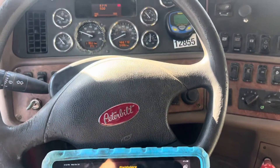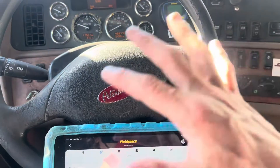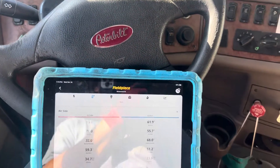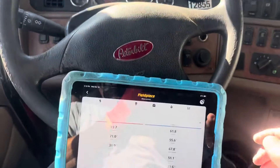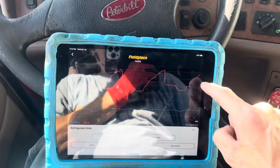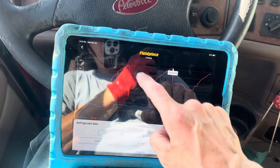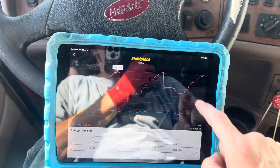We're out in this vehicle, you can see we're at idle. I'm going to have to touch the pedal because it's going to shut off — we're in California, so on diesels they have to shut off after three to five minutes, which ruins any kind of test. Let me put the idle up. Let's look at our pressures: 283, and right here it goes up to just over 300 — 307 psi, 298 psi.